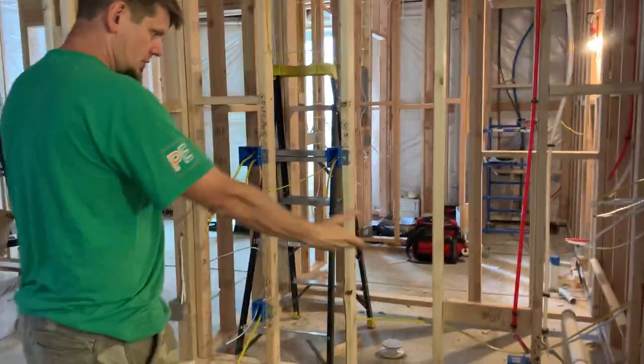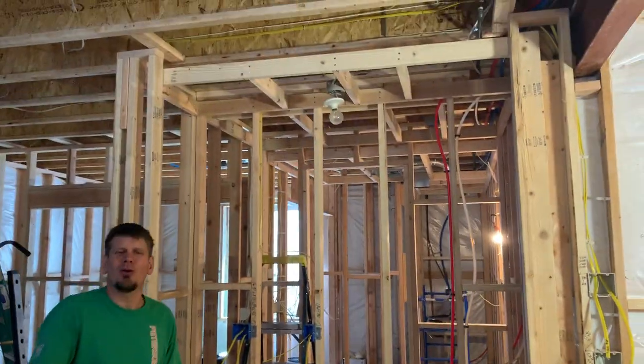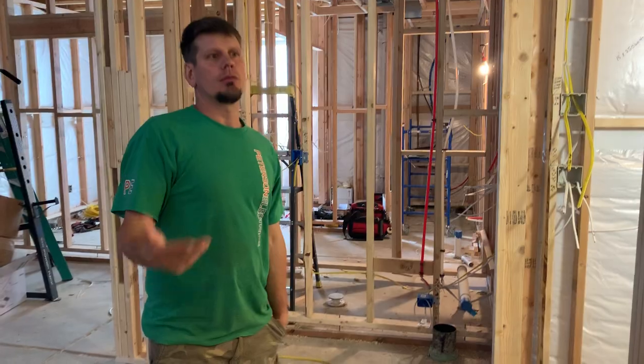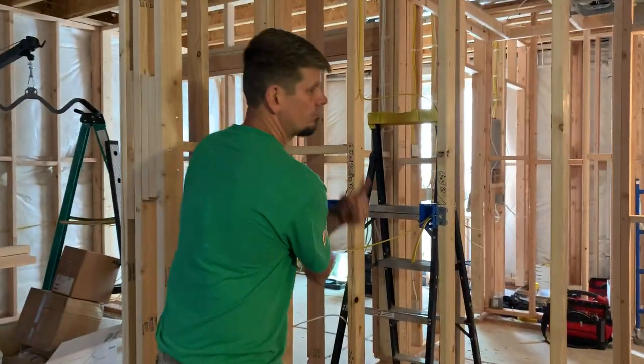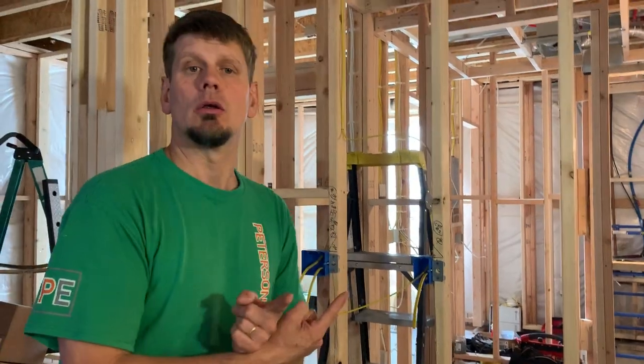As you walk in here, here's a kitchenette. If you're going to put in a refrigerator, have a microwave mounted on the counter, and a garbage disposal, it's technically a kitchenette — and there's no spot in the code that actually calls it a kitchenette. So some electricians come in and put one circuit feeding everything — and then that microwave is nuking popcorn while you're trying to make a margarita and you pop your breaker. You can't do it that way.